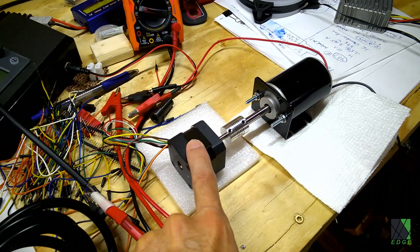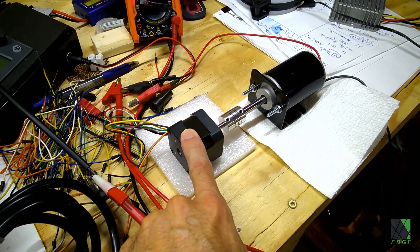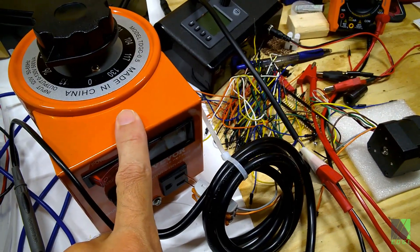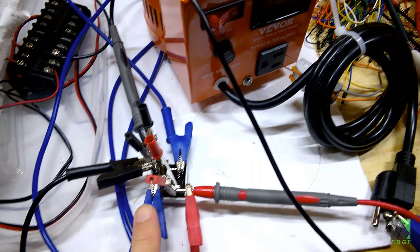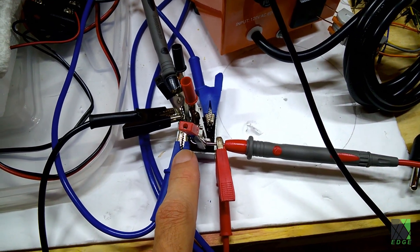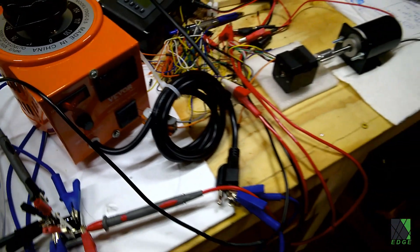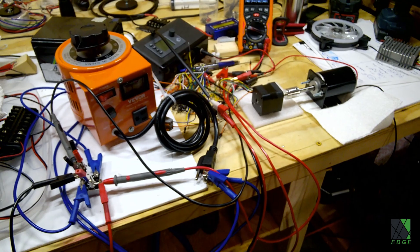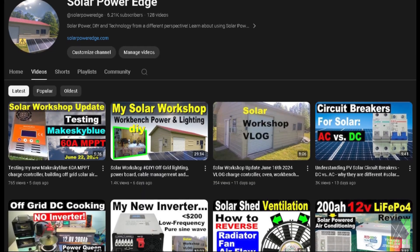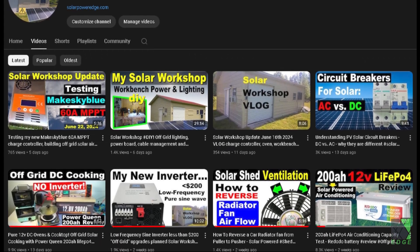Just a quick recap of how this works: a DC motor is connected straight to a 12-volt DC solar panel. This drives a BLDC three-phase AC motor — spinning this motor generates an AC output. That AC is then brought through a transformer and stepped up to a higher voltage, rectified, and sent over to a larger battery bank with higher voltage to do the charging. In effect, this is a very low-tech electromechanical DC-to-DC boost converter. All related video and playlist links are posted in the description below — thanks for watching and hope to see you next time.